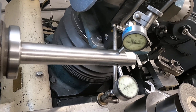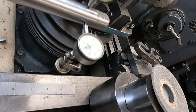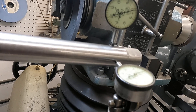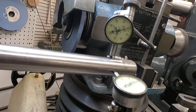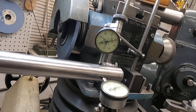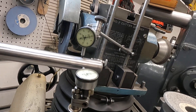I think we can get this one pretty good here. We've got just a little less — let's say one half of a thou. Five inches out — I say that's pretty darn good for runout.